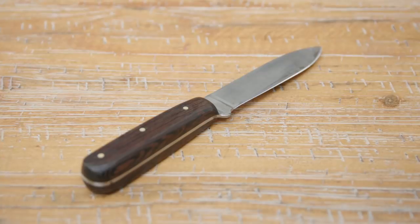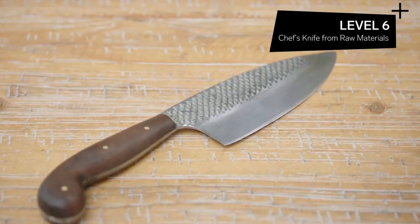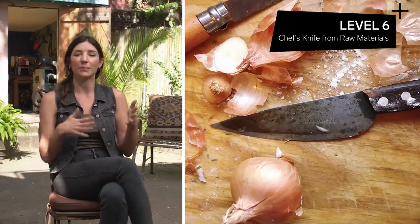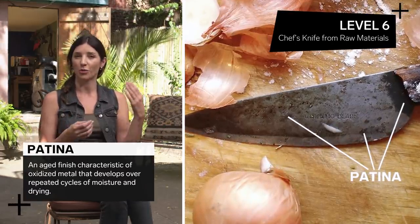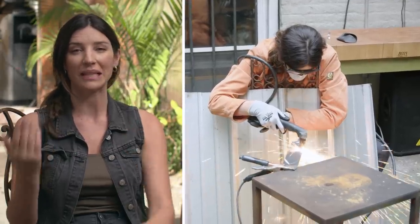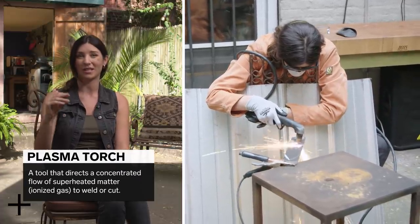The next and final level will be the most complex. Level six: chef's knife from raw materials. In terms of sourcing raw materials, there are a lot of options. You can choose types of steel depending on what you wanna be cooking — stainless steel for your blade, or I prefer high carbon steel, as it's got a lot more characteristics and takes on a patina over time. The relationship you have with your knife is much more involved in oiling and drying. In terms of cutting your raw material, you could use an oxyacetylene torch or a water jet, but my personal preference is a plasma cutter because it's a very thick piece of material — the plasma cutter is the most efficient way to cut through material that thick in a matter of seconds.